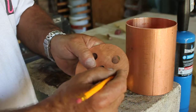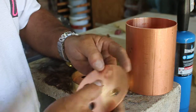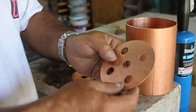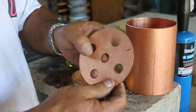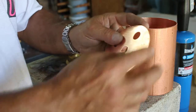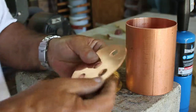I'm going to put an orientation mark on here, then take it to the sander and sand the edge just enough to fit it in there. It typically takes about two, sometimes three passes. Make sure you put an orientation mark so you track one full turn — if you overshoot, you'll take too much off and have trouble soldering it in.